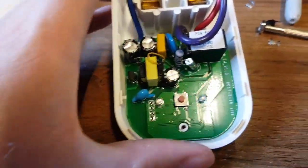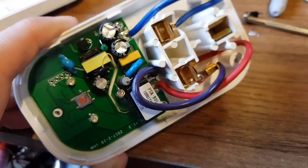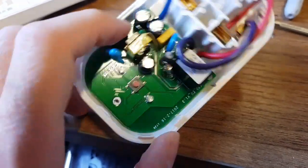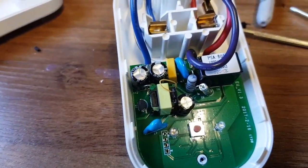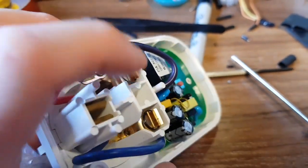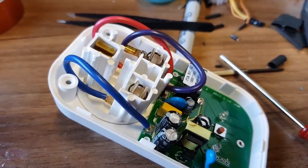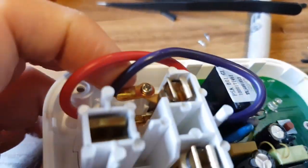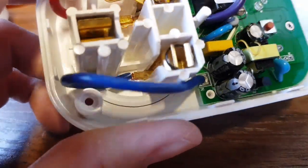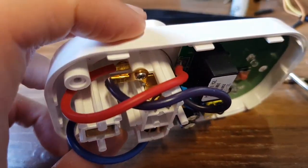There's your little safety shutter thing for the British sockets. Two LEDs for your on and off. This is probably going to be charged because we've just plugged it in. There's not a lot on there — that's less than I was expecting. Look at these terminals — they've got a spring around them to keep them closed. The live feed is actually held by a ring lug onto the terminal. Is that a ring lug at the bottom as well? That's just to hold the terminal in, I think. So that is actually crimped in — a crimp on a ring lug, which looks like an afterthought. That's a bit strange.